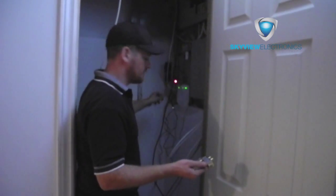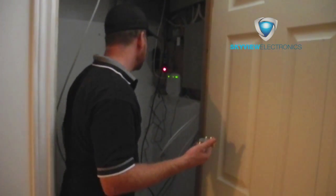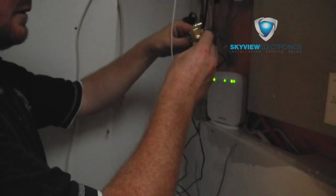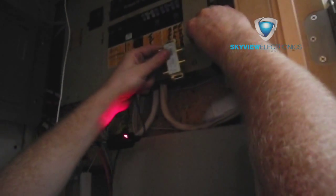What we're doing now is hooking into a four-way splitter to connect the TVs. This port here is our input because it's coming from the antenna, and it goes on here. Then we've got the various wires going to the different TVs in the house.